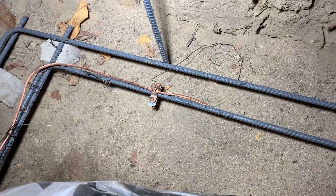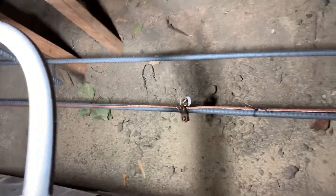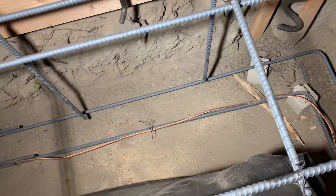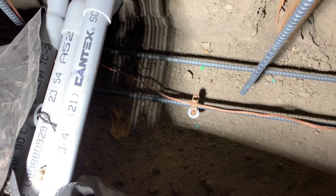Got a bond there on this piece of rebar. This is 90. Tie wire to rebar in certain areas just to keep it trained. Continuous over to here and this next clamp. It has a little 90 right here again, and it passed that joint of the splice point between the two rebars. Last point of connection right here, so I got basically three points of connection.